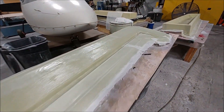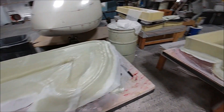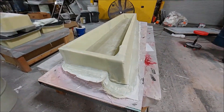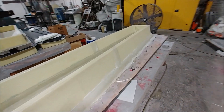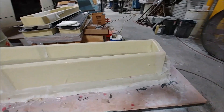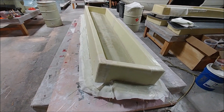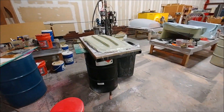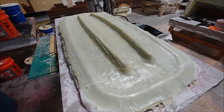There are a couple more molds that are now finished with the heavyweight layers and just need their bracing. We're getting through the last of the rudder molds, so we basically just have the elevator molds to do. This one's finished — just needs bracing put on it as well.